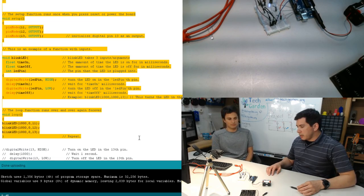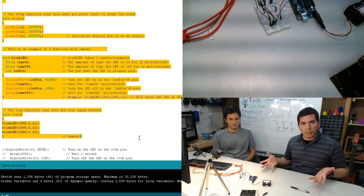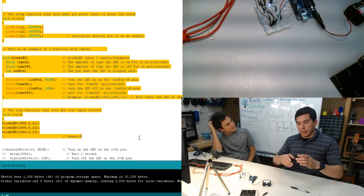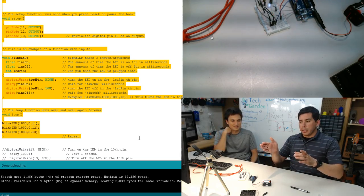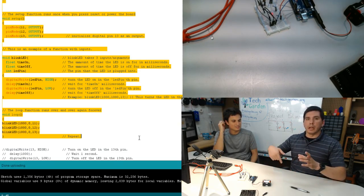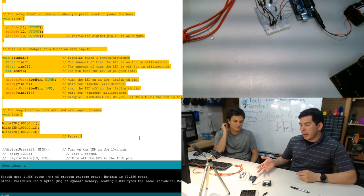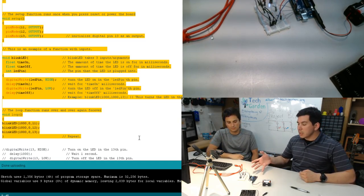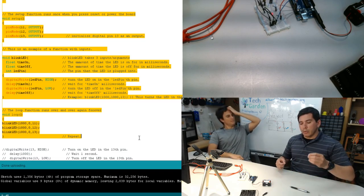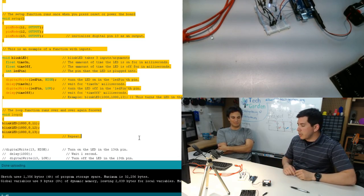And this is actually one of the things that kind of dovetails with what you were talking about earlier. Say you want to turn on a lamp in your house. Well, the power that's coming out of the wall is 120 volts. This isn't going to turn that on. What you can do is use a relay, and all a relay is, is a coil that has a switch attached to it. If you turn on the coil, it draws a switch to it and connects the circuit. So you might be able to turn on the coil with 5 volts, but then closing the switch allows you to connect to the 120 volts for your light bulb. Right. So if you need something that needs more voltage than what the Arduino can supply, or more current, then you typically use something like a relay, which says, okay, if I can't supply the power, I'm going to provide the signal that will connect you to the correct power. And that's all really what the relay does.